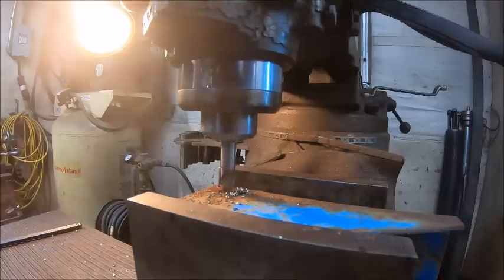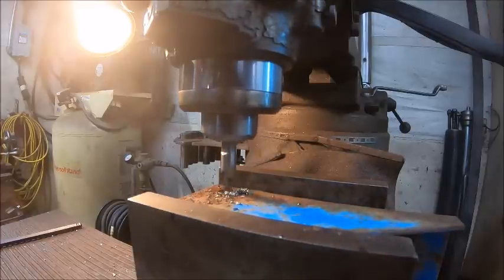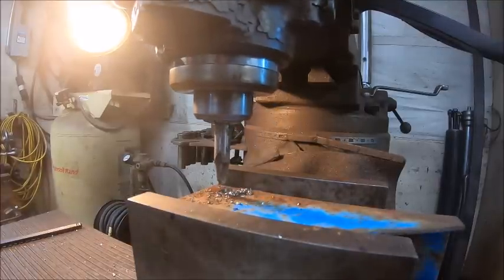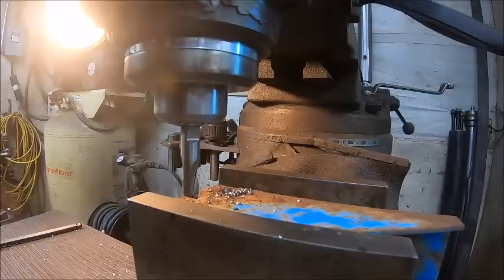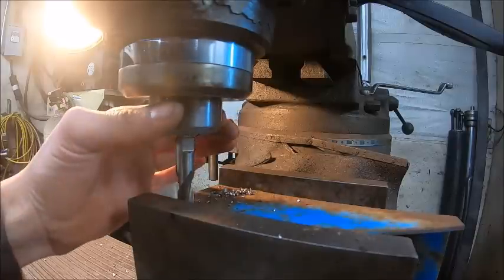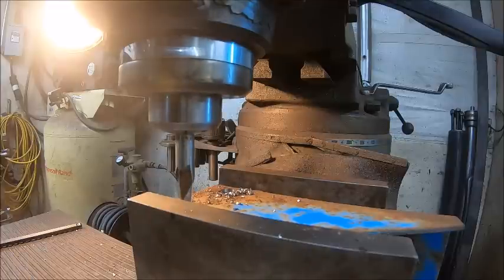It wouldn't be so bad with a 4 flute mill, but we only had a 2 flute that was the right size, so gotta work with what you got. And since nothing about these is precision, I basically just set the mill by eye.